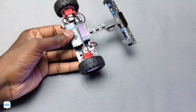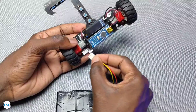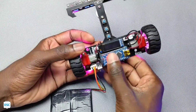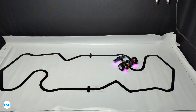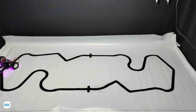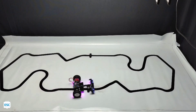This is my 5-channel homemade IR array — you can find the tutorial linked here. You can also use a QTR-8RC sensor here. That's all about the assembly. I uploaded a sample sketch and connected the battery. Note that this code is not PID-based; I am still developing the code, but it works without any problem.